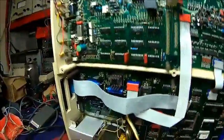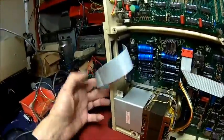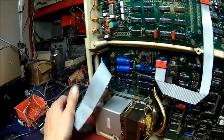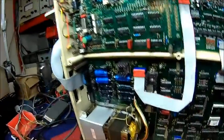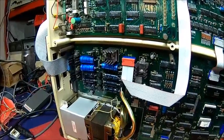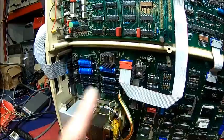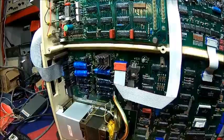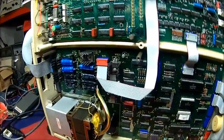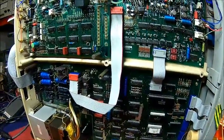Let's check the 5-volt rail — what goes in and out of the regulators. These are all 78-series regulators. This connector here is just the HPIB/GPIB — I don't know why I always say HPIB, I'm biased by the HP equipment probably. Let me check the voltages in and out of the regulators just to make sure there's no excessive ripple on any of the signals.